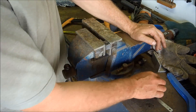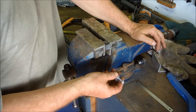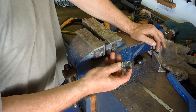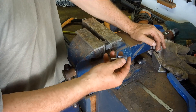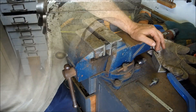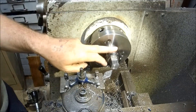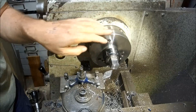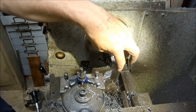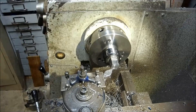I'm just going to set this up in the sander, give that a lick back, and set this up in the collet in the lathe and just machine that back. Then we'll set up to do the counterboring and drilling. I'm just licking this back now — I've got that in the ER32 8mm collet, it's a D14 adapter. I'll click that face up, give it a measure, and I've got to take off 0.1mm — and that's back to spec.